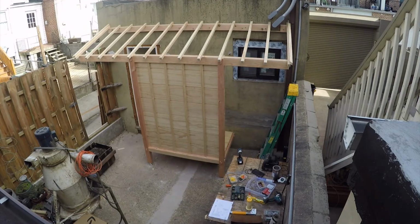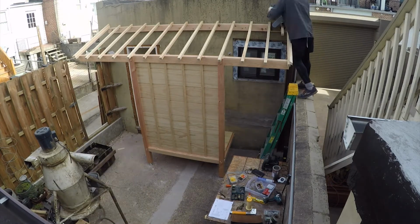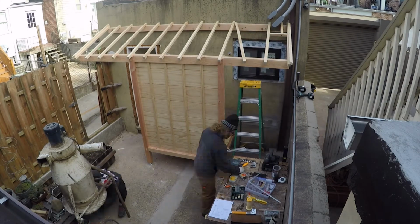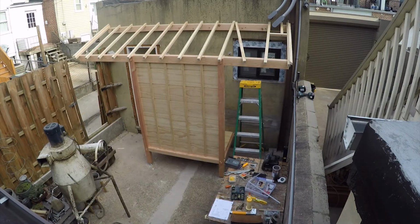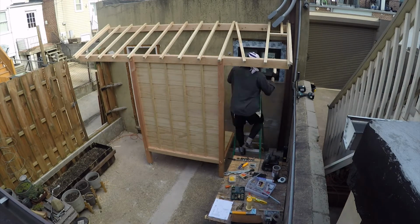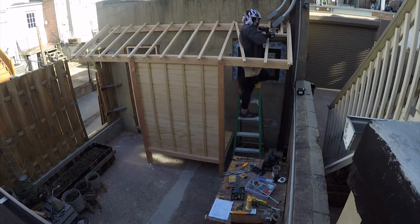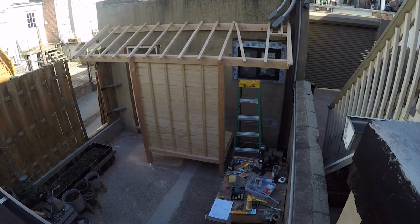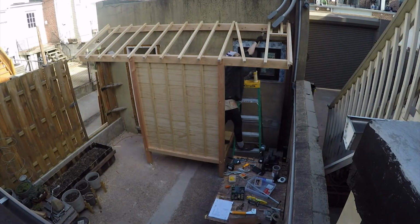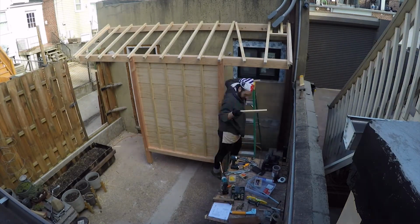Again, when I cut the 45 degrees on the roof trim, I cut it a little small of an angle so that the corners met first. And now I'm framing in the little mini roof, which is composed of a small rafter that goes into a small support and then 2 shallower rafters. And those are all screwed together and then pegged with small oak pegs. I was trying to avoid having screws on this visible, but the pegs kind of hide it.